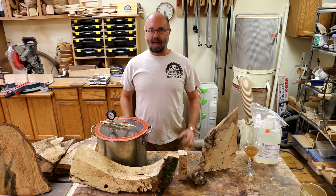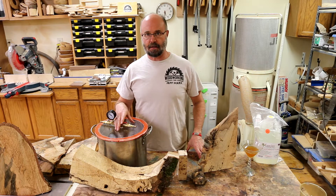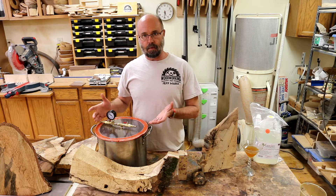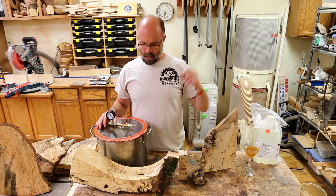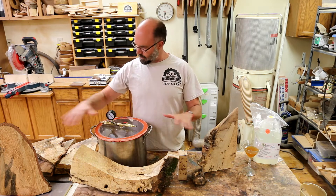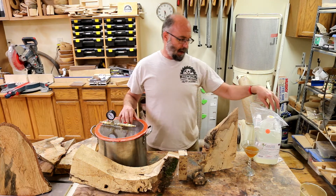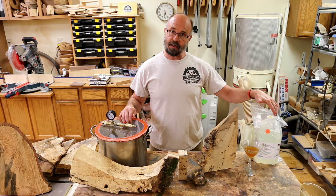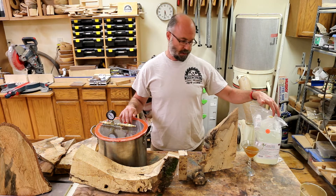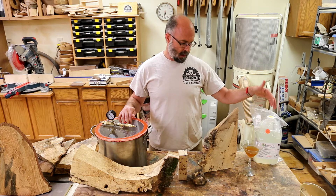Hi, I'm Jeff and welcome to my shop. In this video, I'm going to be using the new vacuum chamber that I just finished making, largely for this purpose, so I'll put a link to that video up here. What we're going to be doing is I have a whole bunch of materials here that I'm going to be cutting up and stabilizing in resin. Over here I have this thermally cured resin specifically for stabilizing wood — it's called Cactus Juice. There's another one called Stickfast that I understand is fairly similar, but I'm using this.